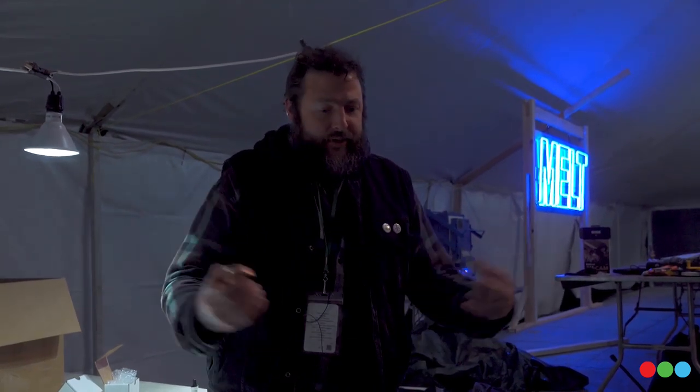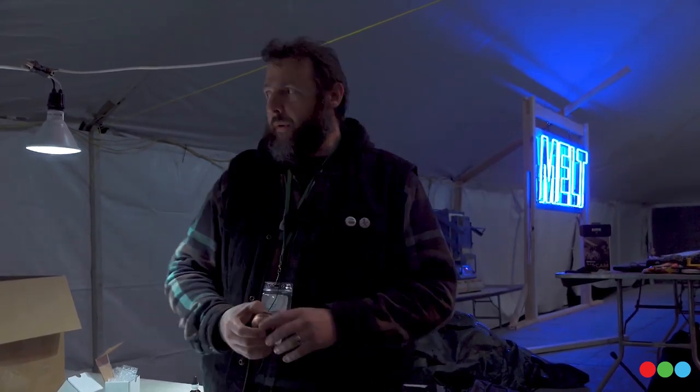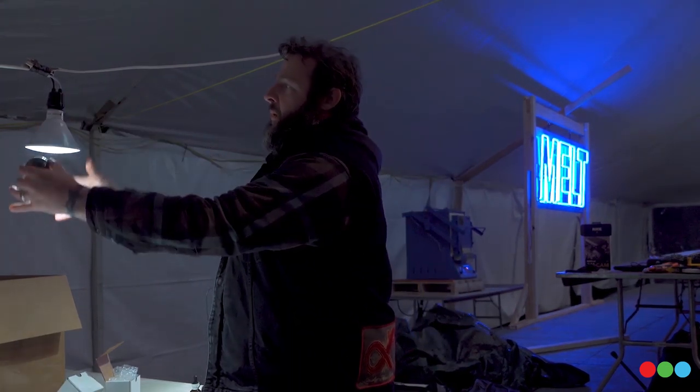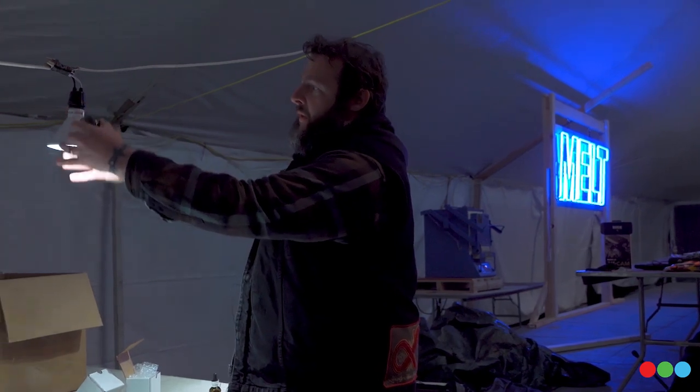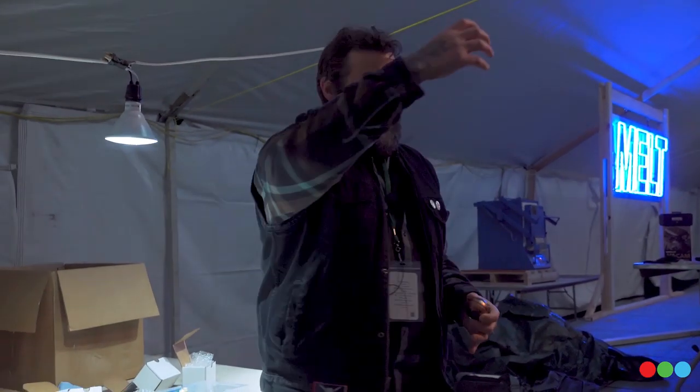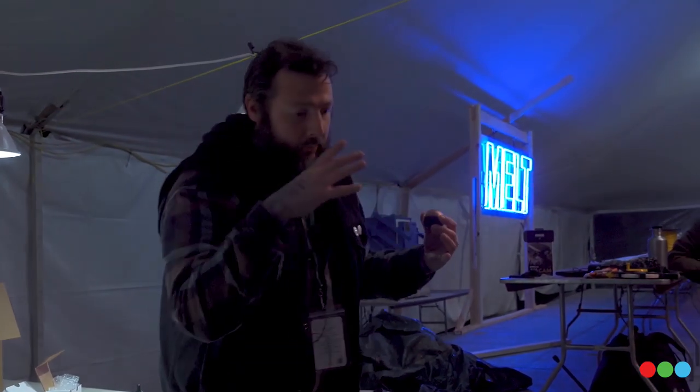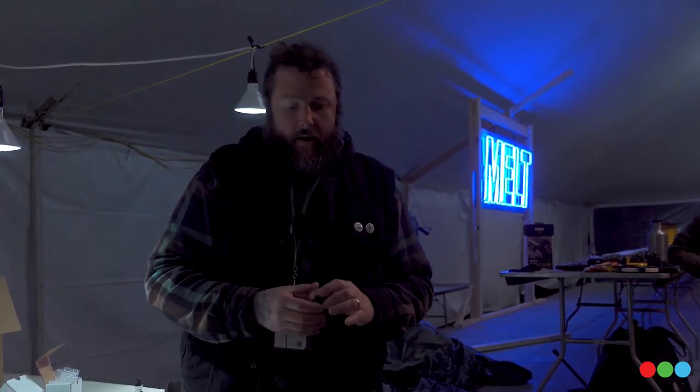My biggest thing that I did, since I'm sandblasting small stuff, is I put in a little LED, one of those lights that have the metal part for like a chicken coop or something. I use that with an LED bulb, and I just place it right on the glass of my sandblaster, so it's just blasting light right in, and I still have plenty of room to see what I'm doing in there.